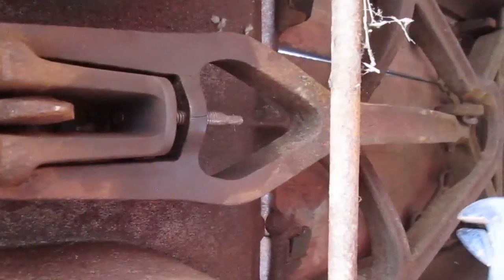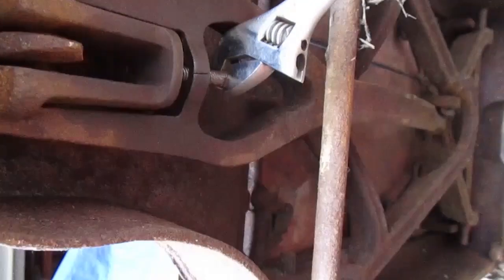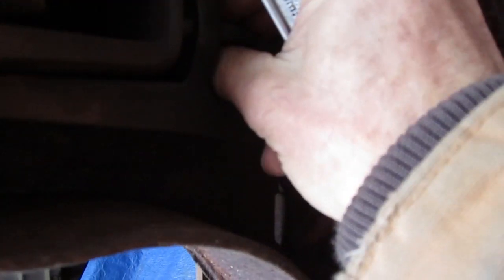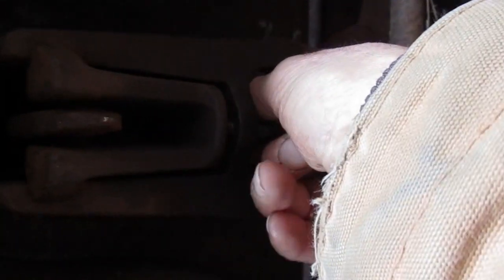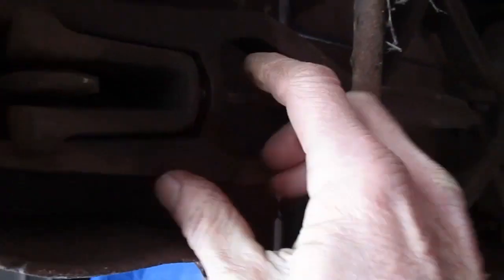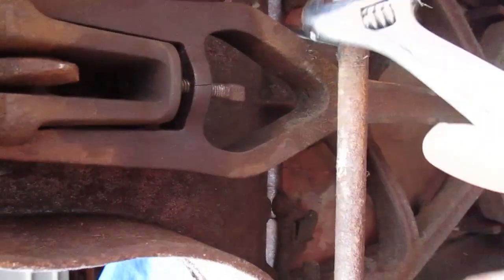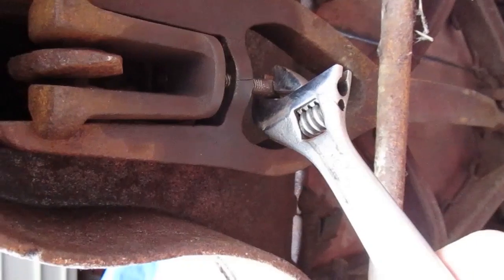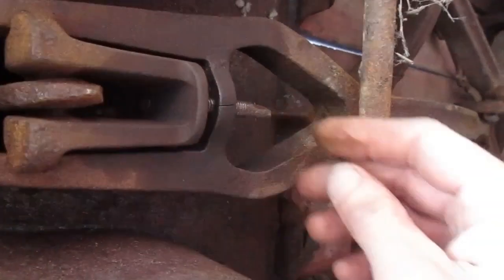I'm under the scale again. So far I've been tightening the screws by hand, but now I'm close so I'll start tightening with a wrench. You don't need to get the wrench to the upper bolt — loosen the bottom set screw, move the upper bolt, then tighten the bottom set screw. Don't over-torque it; there's a lot of flex in this design and it might strip the threads before it feels tight. You can expect to get under here a number of times trying to find the sweet spot.